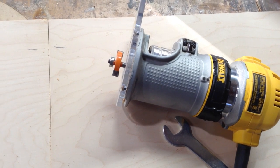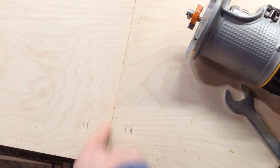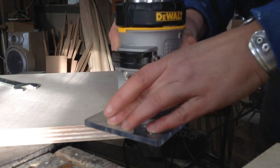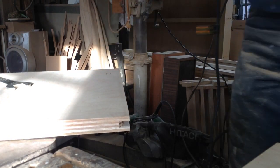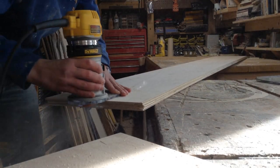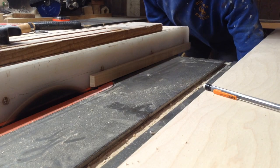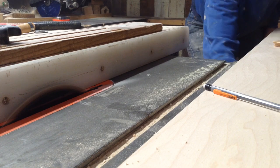It's going to be detachable. To attach them, I'm going to be cutting a groove in both of them and then putting another spline in the middle. So I have a slot cutting bit in my router. I can set it to the right depth, which is about halfway down the piece, and I can gradually cut that slot. This is not a high-end bit, which is why I go pretty slow and do multiple short passes because if not, it will start to burn. But I cut two slots in either piece, and this bit right here is 5/16ths. So I had a little piece of poplar laying around, and I just trimmed it down to 5/16ths, and that will act as my spline.